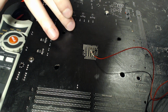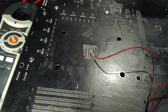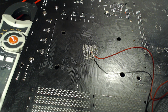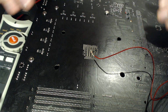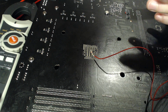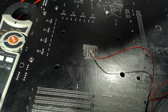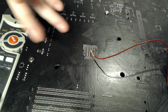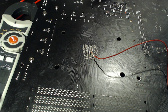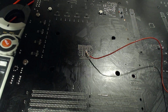So I really want to know if the Taichi is actually managing, like, does the Taichi's level 4 LLC plus 1.45 volts match the Prime's voltage under load, or is the Taichi just a better VRM and the voltage is actually drooping well below 1.4 volts and the Taichi is just still maintaining that 4 gigahertz overclock? Because this board has a 12-phase VRM, the plus is a 4-phase, so this should run cleaner power, and this is really the only good way to test that, other than hooking up an oscilloscope to the VRM, but with the oscilloscope I have, that doesn't tend to go very well, so, yeah. So, that's it for this video.